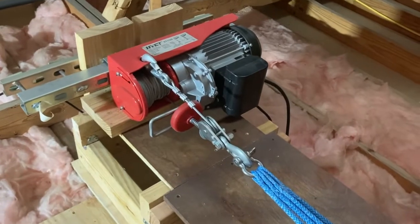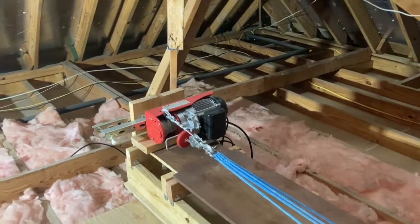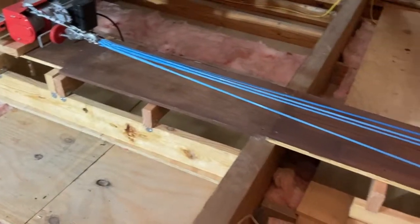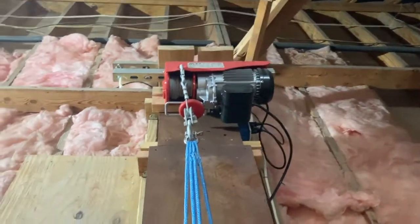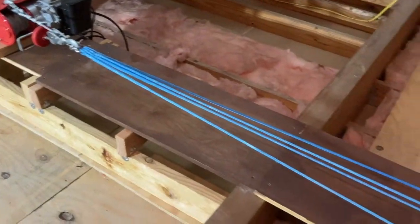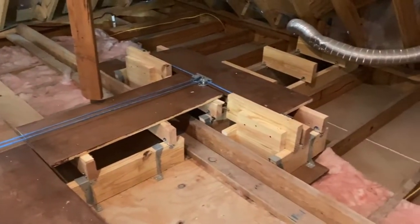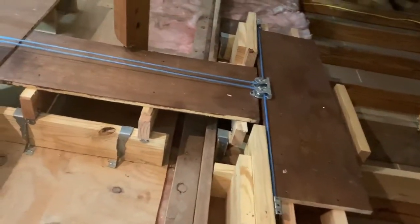Here is the electric hoist that normally is mounted vertically lifting straight up, but in this case I put it horizontally. I used a whole bunch of scrap wood that I found — some two-by-tens and two-by-fours — and these darker boards are just old shelves from a shelving unit that I assembled. There's an electric hoist like a winch motor with power run to it, and I used these steel cables — marine grade cables that have near-zero stretch under weight — so I wanted something that stayed the same length under weight.